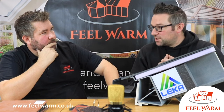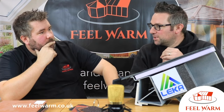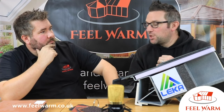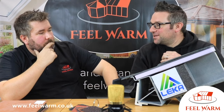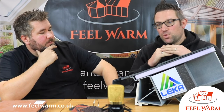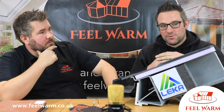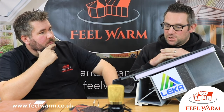And they even sacrifice on insulation. They might only put 75 in between the rafters with a 25 mil board. So even though you pay this money, and let's not deny the fact that yes, it's going to be cheaper, cheaper isn't always good, is it? At the end of the day, they're going to put half the insulation in, and you are still not going to get that room that you're going to use all year round. It doesn't even come close. So, yeah, big no-no.